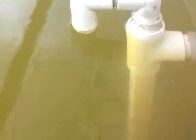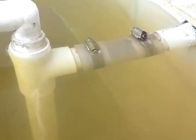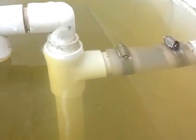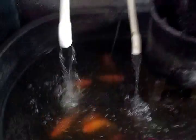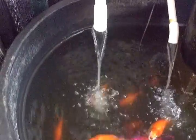This is 100% dependent upon this little elbow at the top of my standpipe that goes back down into the water. My water level in my tank is actually over top of that horizontal piece, so my overflow is actually constantly 100% underwater. If you were to rely on gravity by itself on a 1-inch pipe like this, you would never be able to get 300 gallons per hour out of it. I'll take this top piece off just to show you how quickly this changes — see how quickly that changed? That easily cut in half, if not a little more.